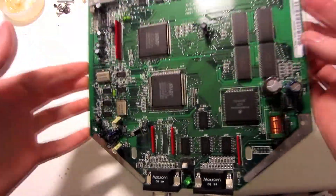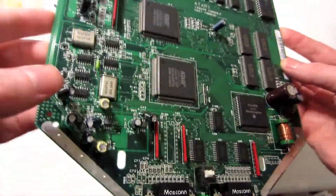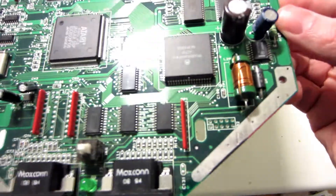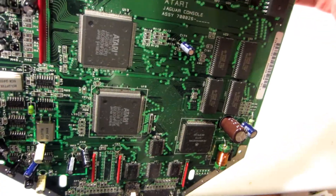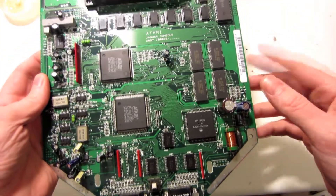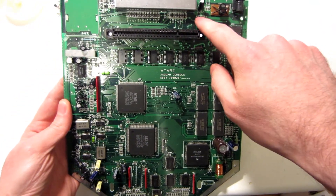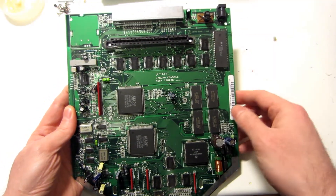So here is the motherboard. Checking it over, it seems okay. I don't see any bulging capacitors. Yeah, a lot of dirt. Even the U38, the main voltage regulator, looks okay. Anyway, I'm going to replace all the caps. I will also add a voltage protection diode here, which the factory actually didn't install, but it protects from positive or negative tips being connected accidentally. So let's do it.